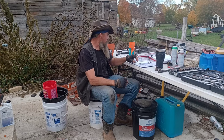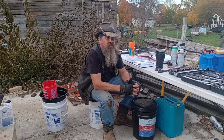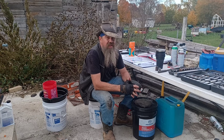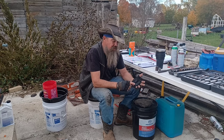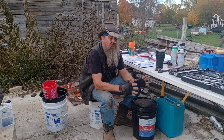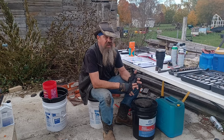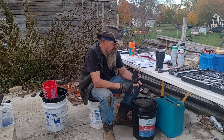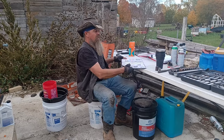So, some stuff we need when it comes to hydraulic oil. The thing to be prepared for is this system takes 3.6 gallons of hydraulic oil. That's if you have the HST-D. The other systems, the two-wheel drive hydrostats and the manual transmissions, have lower amounts needed, but for the HST-D you need 3.6 gallons. So you've got to make sure you have the fluid and also make sure you have somewhere to put it. Now the fluid we use, Kubota gives us a list here.